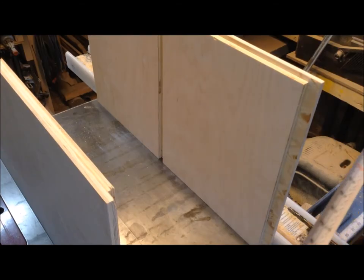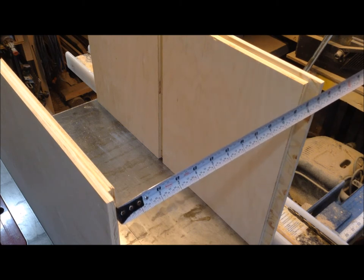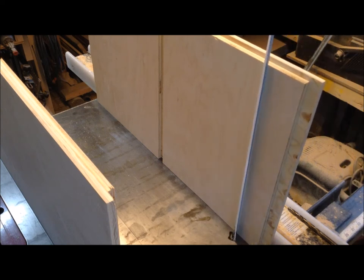With that setup, I can now measure the inside dimension of where I cut my rabbets — that's 12-7/8". I'm probably going to round that up to 13 inches just so you have some space to put your fingers on either side of these cubbies. So all of these have to be cut 13 inches wide. I can also go through and measure the height now — it's 15-3/4". You want that shelf to not come past where you cut that rabbet, so you don't have to cut rabbets into the top and the bottom — just make them short of the back. Since the two sides are different dimensions than the inner ones now, I'm going to be cutting six pieces at 13 inches by 15-3/4".